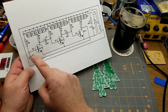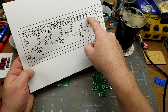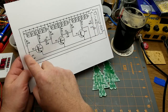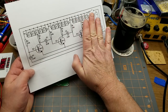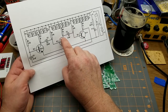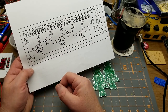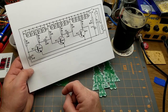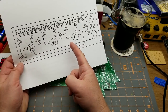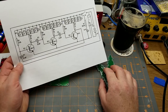When the transistor turns off, it'll discharge through there — yeah, because both sides are connected — so it'll discharge through the resistors and diodes. And basically it'll just keep oscillating around. Not sure which one starts first — I guess it depends on which has more leakage or residual charge on the capacitors. Actually, maybe I should breadboard that sucker up first. Yeah, I'll do that.